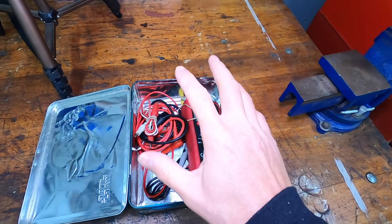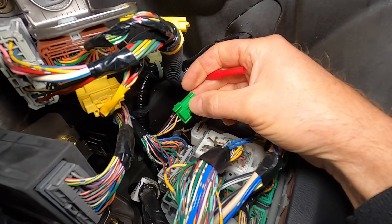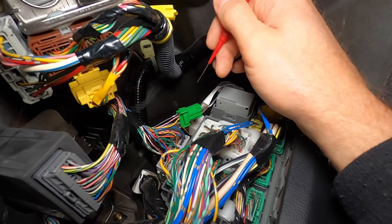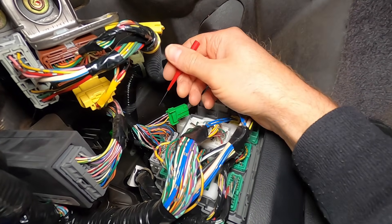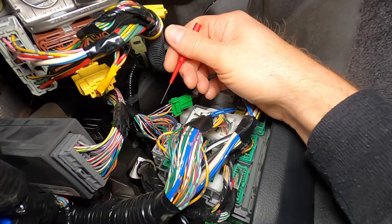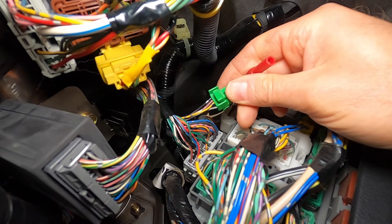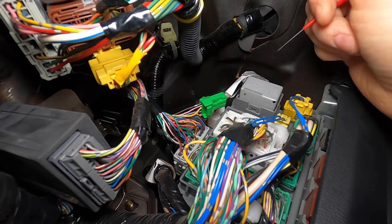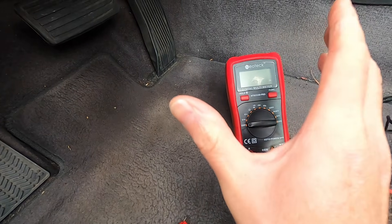Testing the wiring is painless enough — we just need a digital multimeter. I'll link all of the tools in the description box below. I want to check the wiring to verify we have no blown fuses. Very quickly: black is our ground and yellow tends to be our power wire, so we can test both. The other two wires are most likely running to or through the fuse box, so we can quickly check everything.